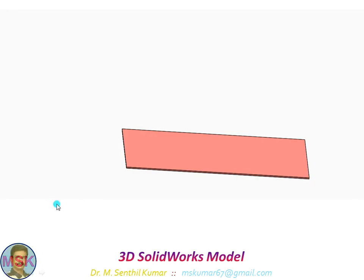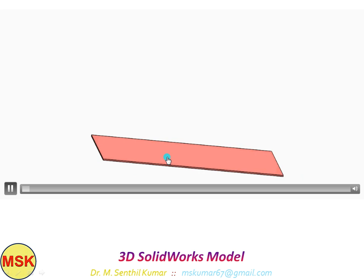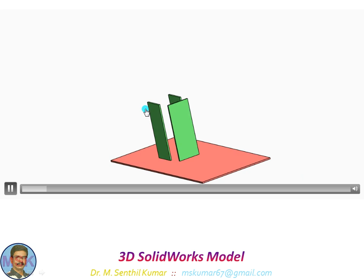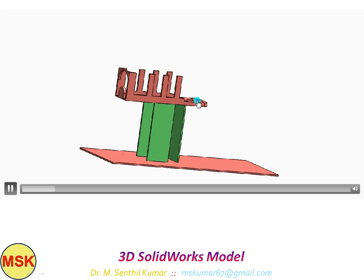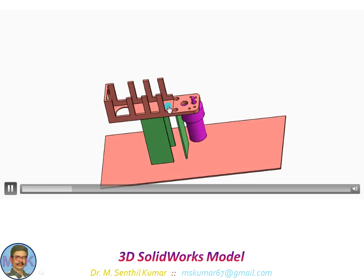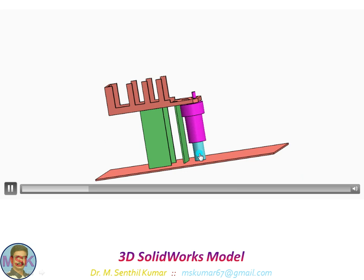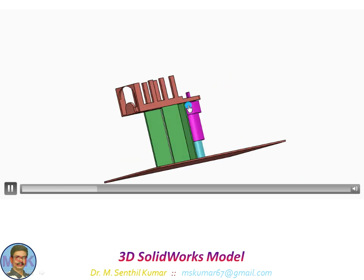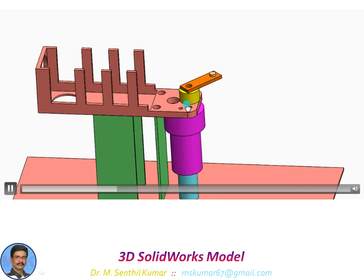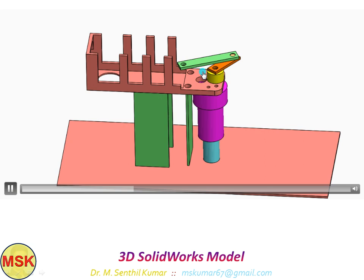In this video, you will see about how I made the SolidWorks model for this particular project. This is the base plate. Support plates will be fixed over this base plate and the main component is fixed here. The main slider cube will be sliding in left and right direction. To make that movement, a motor is fixed — it is a heavy motor — with a support given for it. I attached a slider mechanism to the motor, so this motor controls the slider mechanism. The rotation is converted into a linear motion — a to-and-fro, reciprocatory motion.